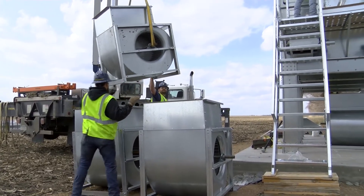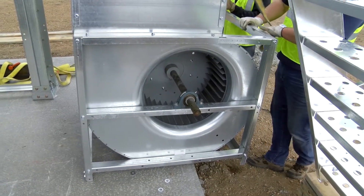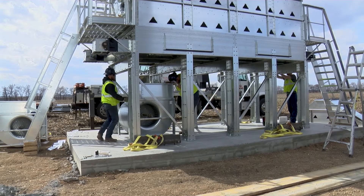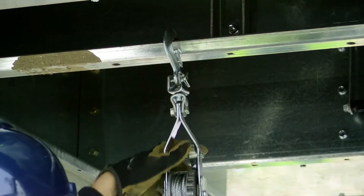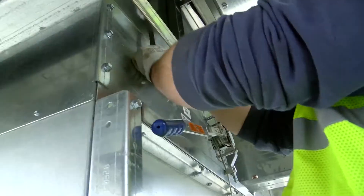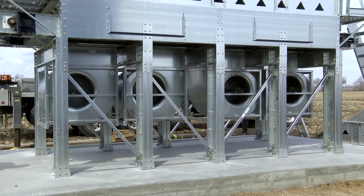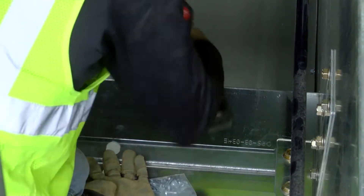Lift the fans by attaching a strap to both sides of the fan shaft and cradle lift the fan over to the end of the concrete pad. Note the orientation of the fan housings by referring to section 13.1 in the installation guide. The round fan shroud will point away from the center leg. Once the fan is in position underneath the dryer, either by brute force or using rollers or a pallet jack, they can be hoisted into place to be attached. Using a come along or a chain hoist on each side, lift the fan into position using a punch to guide the fan into its final position. Attach the fan using half-inch hardware included in the fan installation hardware. Once all the fans are installed, the fan filler plates need to be installed from inside the dryer. Slide the filler plates into position and use the supplied self-drilling screws to attach the plates.